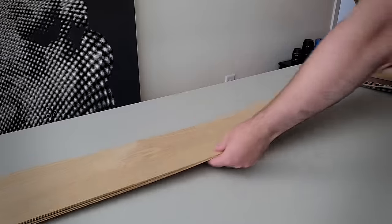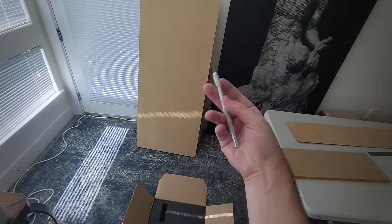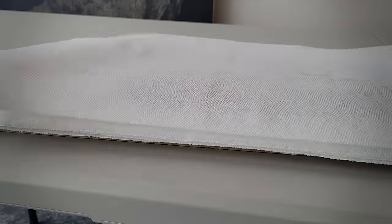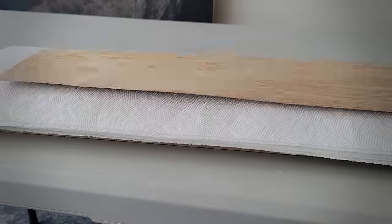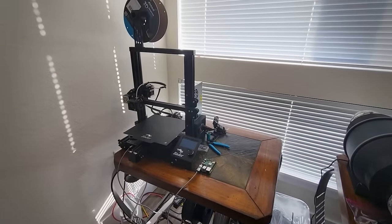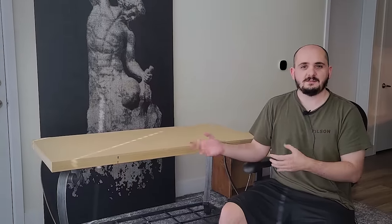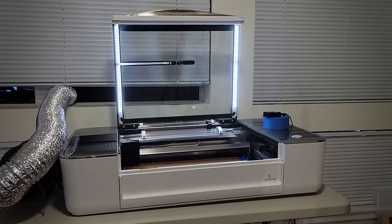The new tabletop structure is done and it fits now — they just slip right over top of the existing ones. We have our blank canvas done, so let's make some art. While I'm planning out the rest of this, I'm going to get the veneer prepped. I want it as flat as possible, so I'll cut it to size, wet it all down, and then clamp it together, changing out the paper towels every 12 hours or so. The extra inches on each side will help fit my 3D printer and laser cutter a lot better. These are just meant to serve a temporary purpose until I can build my own tables — afterwards I can take these off and repurpose them as wall art.